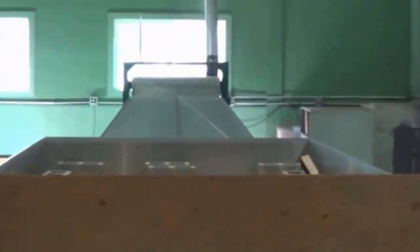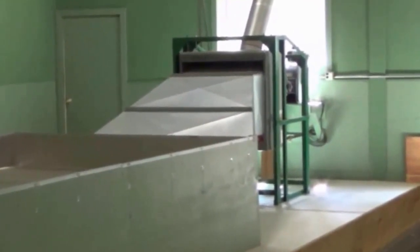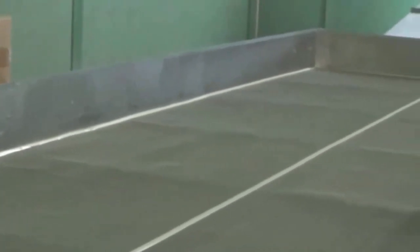The way the dryers work is on that end we open the windows and there's an air intake through the window. We have two dryers — they're propane heaters. The air gets heated and then blows into the plenum underneath the product bed, which is the screen. They're lined with aluminum so it's all a cleanable surface. It takes about 48 hours to get it dry, down to 8% moisture content or less.